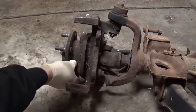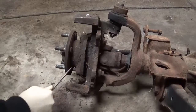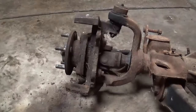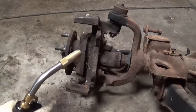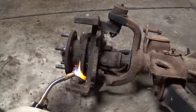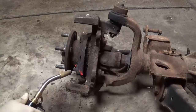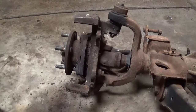You can also grab a screwdriver and scrape it off. You just want to get the loose stuff off so you can get good heat penetration. The other thing I forgot to mention is penetrating oil — that's good stuff to use, but it's very flammable so I'm not going to use it right now while heating. Sometimes I'll heat it up really nice and then hit it with a hammer. You don't exactly want to heat the bolt — you want to heat what it goes through so it expands and breaks the rust seal.